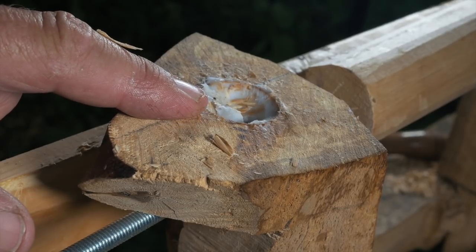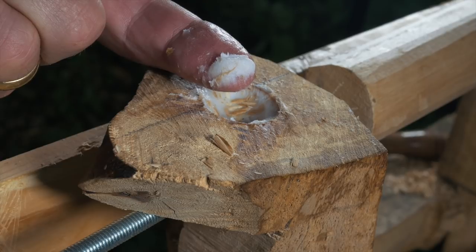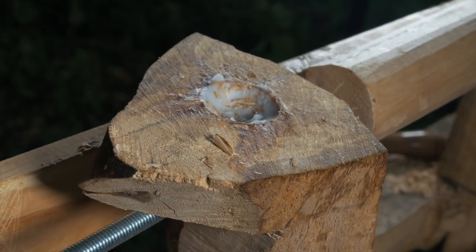In this poppet I've drilled a well. In it there's some lard and I use that to lubricate between the workpiece and the spikes. So that's my very very simple spring pole lathe.